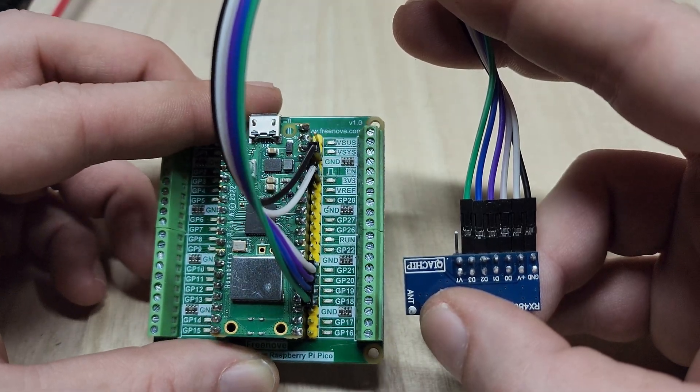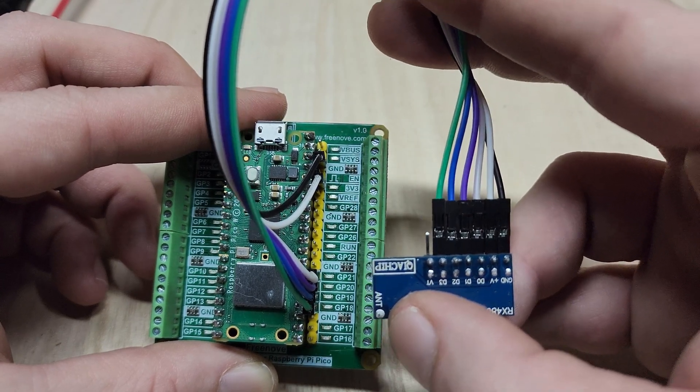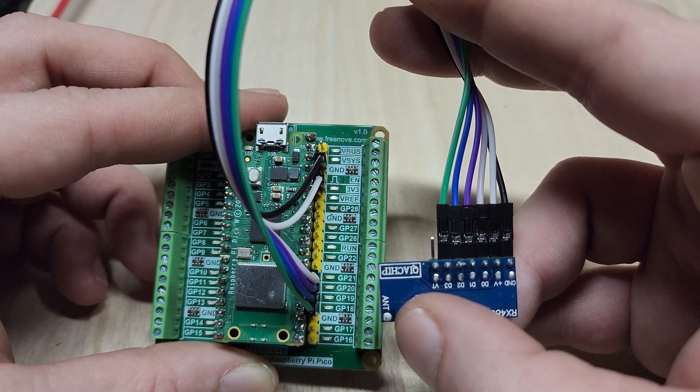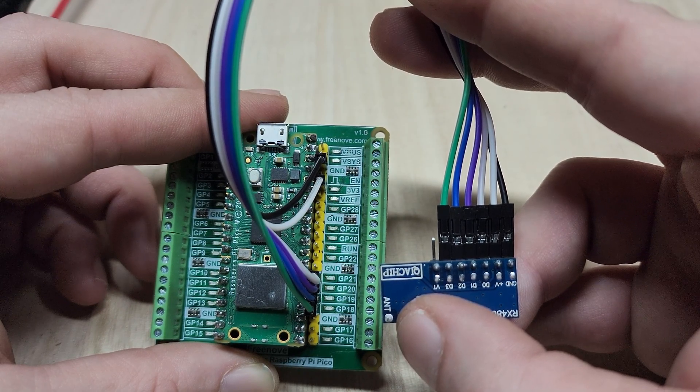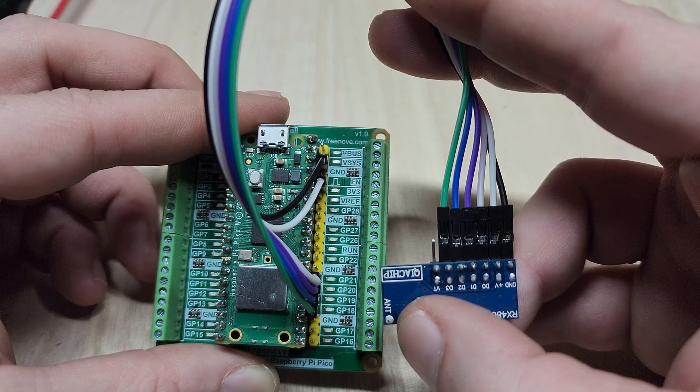The wiring for this build is minimal and fairly straightforward. On the receiver, the ground pin goes to a ground pin on the Pico, the voltage in is wired to the 3.3V pin on the Pico, and the four data pins can go wherever you like to put buttons — I'll use GPIO pins 18 through 21 here. I'm not going to bore you with the code because it simply accepts a button press and sends an MQTT message when that happens, but I'll make it available on the GitHub — link in the description. You can do this with a full Raspberry Pi or a special shield for the Pico if you want Ethernet, or you could use UART to send the data from the receiving Pico to another device.